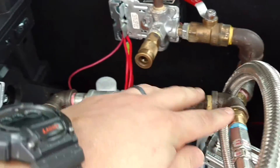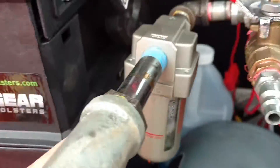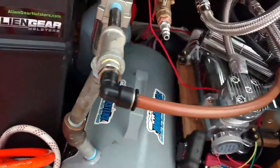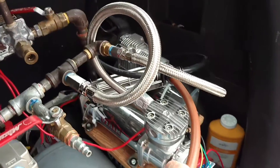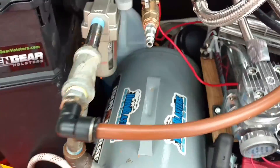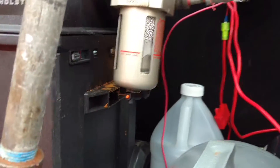So the air comes in from either one of these ports, coming through here into the air mist separator, and then comes in here to my five gallon air tank. It can either go into my five gallon or come back over here to my two gallon. We'll just be focusing on the filter and the separator for right now.